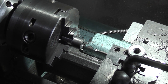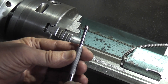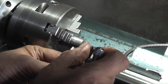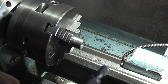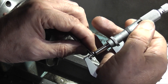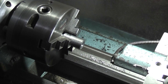The depth is 22 millimeters and the diameter is 8. To check the bore, what I'm going to do is use one of these bore gauges. The way these work is as you tighten the screw up on the end it pulls this in and this diameter opens up, so you put this into the bore, tighten it up until it just touches the bore, then you measure with the mic over the ball on the end. That's coming up at around about 8 millimeters — this is an 8 millimeter bore.